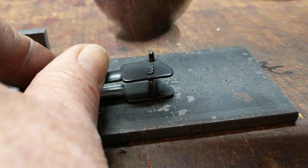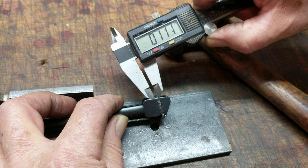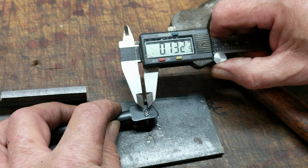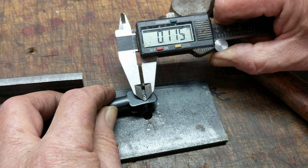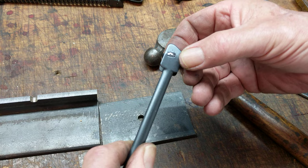We've stopped banging on it — let's check our thickness. Our donor plate started at about 9 to 10 thousandths on this side, but now after repeated hammer strikes it's giving us 11.5. We've widened that out. You may have to bend those ears back a bit, but I don't think it really matters for function. The bottom line is the plate should be a little snugger in the plunger tube now and shouldn't have the issue of popping off the back of the unit — and that can be a real problem. That's all we've got for you today. This is Shane Bruce with Resto Mod Daisy, signing off.